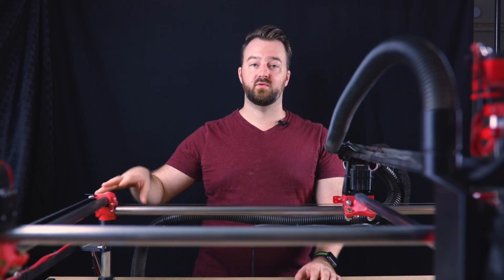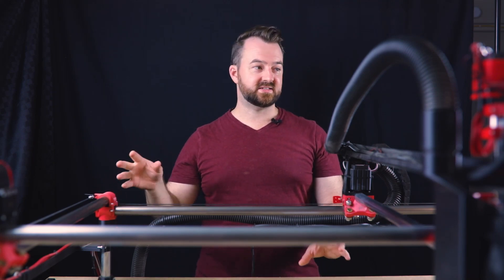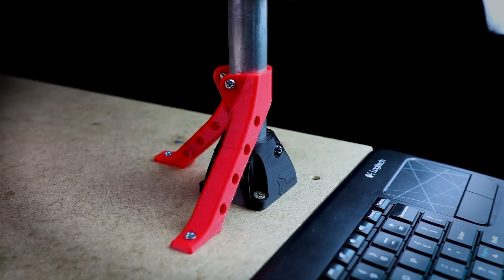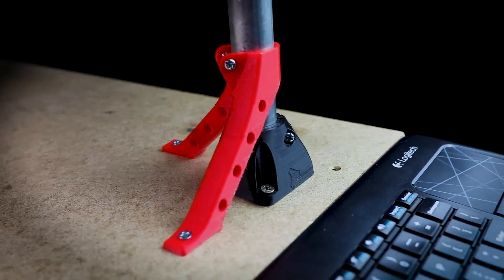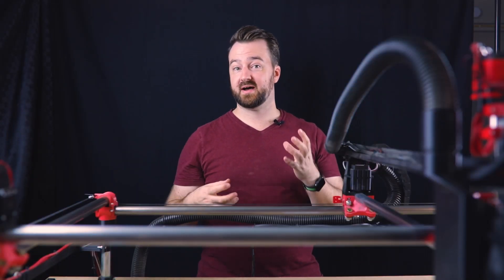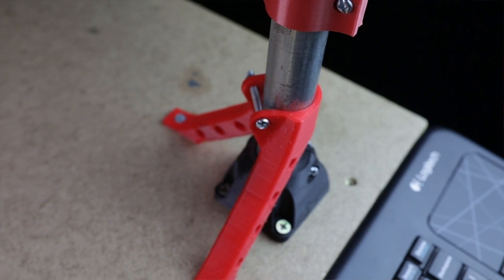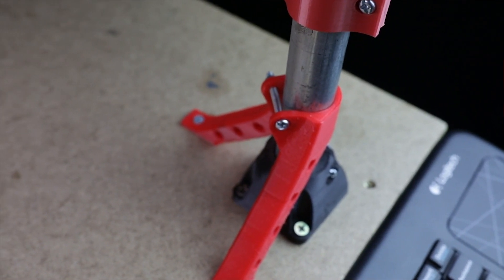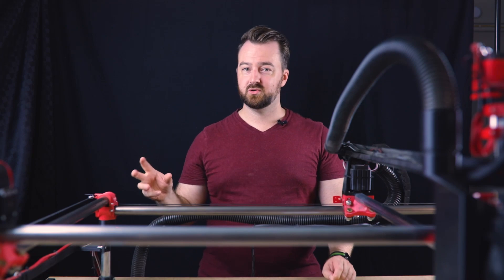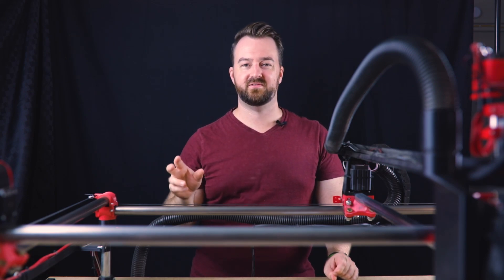The second thing I wanted to improve is the general stability overall in the machine. After some use, I found that the machine started to get a little bit wobbly because the parts started to loosen up and settle in. So I went and created a 45 degree angle bracket that can be installed directly onto the legs of the machine. I designed it like a C-clamp that could easily slip on using one single bolt to fix it to the leg and then screw it to the table. You wouldn't believe the difference — I've gone from about 0.2 or 0.3mm of shake down to pretty much nothing, so it's made quite an incredible difference.